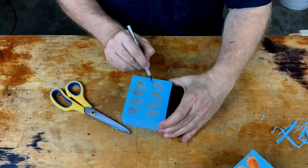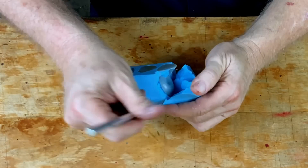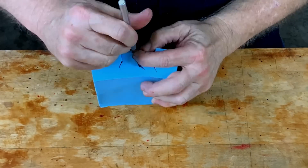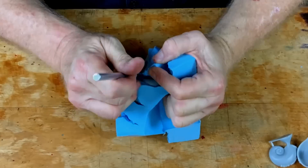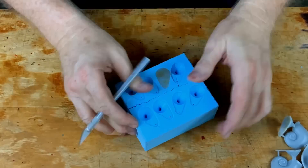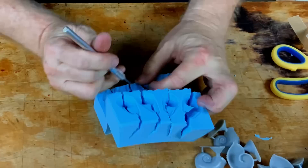These pieces were a little trickier to cut than I expected. To make it easier, I sliced the mold right down the middle, effectively dividing it in half. I was careful to leave it in one piece, though, and not cut it into two separate parts. That's because it's a one-piece cut mold, and the only way to get the mold to realign properly is if it's all in one piece.